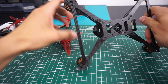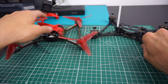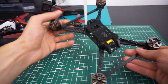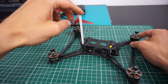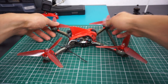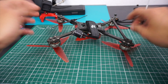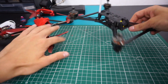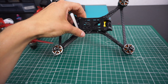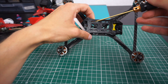These 25 millimeters should be enough to fit three boards. The arms are identical to the RS series, so they'll be interchangeable, and the braces stay the same — the exact same ones as on the RS. One thing I'm working on is this little flip stick, which should allow the quad to turtle. This works much better than a fin because the RS frame is so low that even with a fin the props aren't high enough above the ground, making turtling difficult in higher grass.